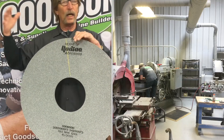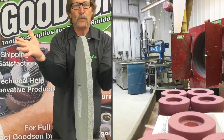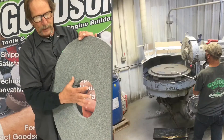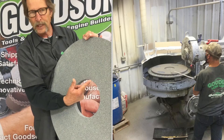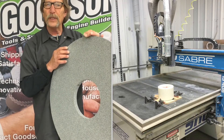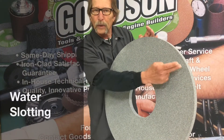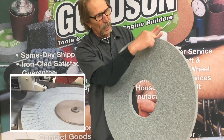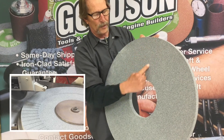We've invested dollars in equipment to alter abrasive wheels. We can change large diameters to small diameters. I can take fat wheels and turn them into skinny wheels. I can take little holes and turn them into big holes. We taper dress if that's what you want. But one of the biggest things that we've been offering recently is water slotting — we put vertical grooves two degrees apart all the way across, which allows us to carry the water not only to the face of the grinding wheel from your nozzle, but we carry it down the side.